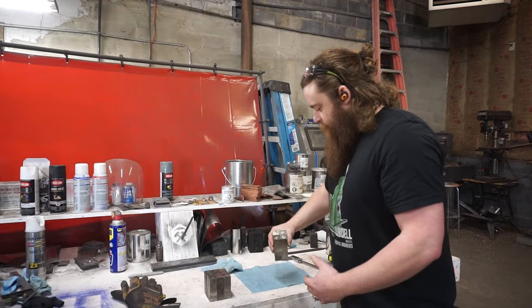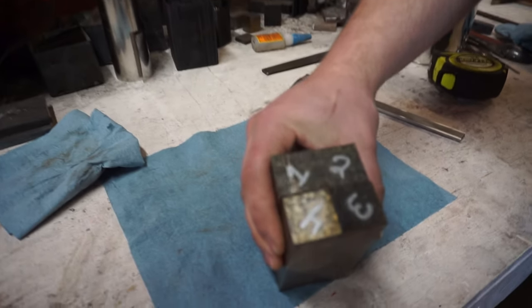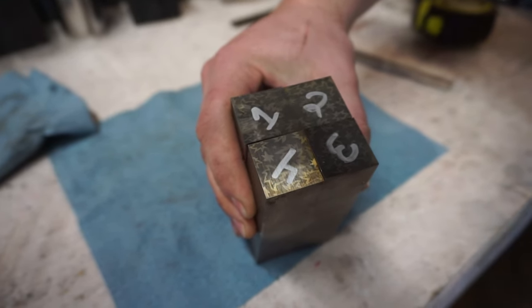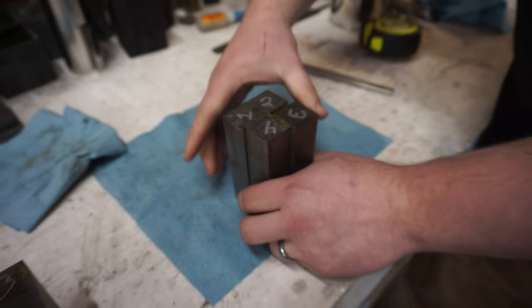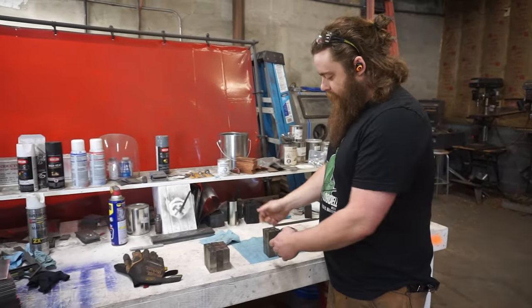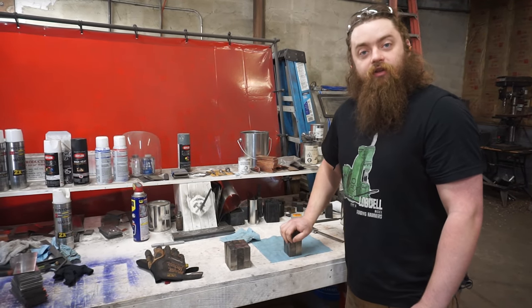On the second one, with the swirling star flame looking thing, again, we're doing a 4-way, so we've stacked it up how we want the patterns to line up. And we're doing the same thing. We're going to Scotch-Brite the surfaces, get them good and clean, and TIG weld all these seams shut. And then we're going to forge weld them all together. Let's roll.